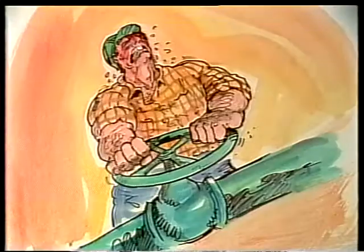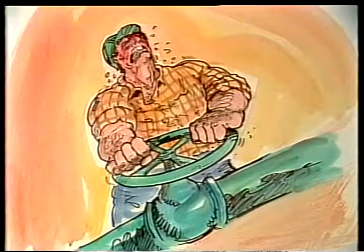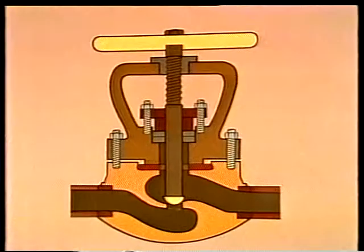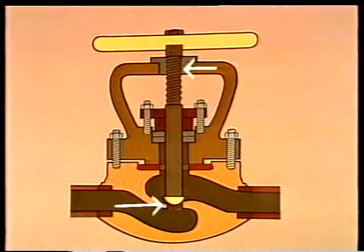For example, take a valve that begins to leak by the disc. Like the sink faucet, you could try to stop the leak simply by using more force when closing the valve. However, that's not a good thing to do because you'd be forcing the disc and seat together, creating excessive pressure on the yoke bushing and the bonnet threads if the valve is like this one. Forcing a valve closed like this will also cause galling of the valve seats.